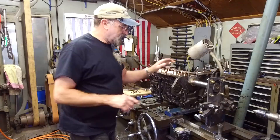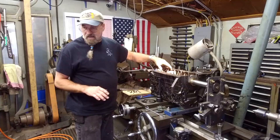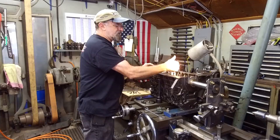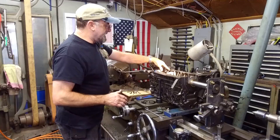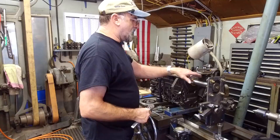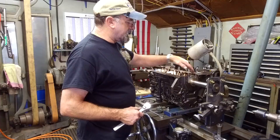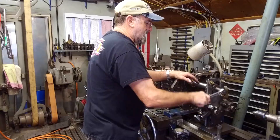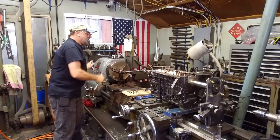We bring this out of gear so we can roll this around. We pulled all of our bearing caps except number two - we're going to start on number two, then we're going to go three, four, five, six. I got the cap off now so we can do the preliminary setup on the bit. I found that 30 pounds of torque on these leaves a good tension on the bar, and we're going to run it at that torque on our bearings.